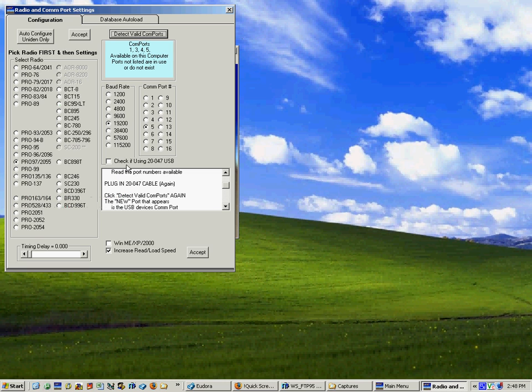Now if you're using more than one scanner and you want them all assigned to the same cable COM port, just check here and any time you click on one of these it will assign every radio to the same COM port so you won't have to set it again. The baud rate is normally fixed by the program at one speed, so no matter whether you choose the wrong baud rate or not, most likely it won't matter because the program will set it again to the correct one. If you come back you'll find it's already set for 19200.